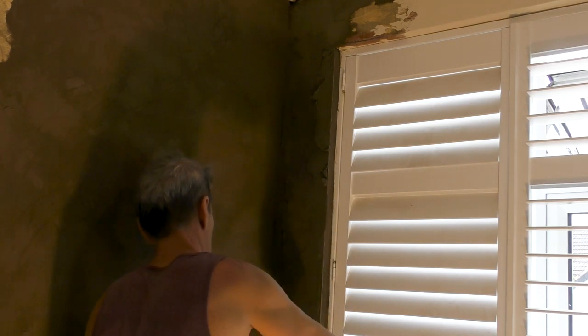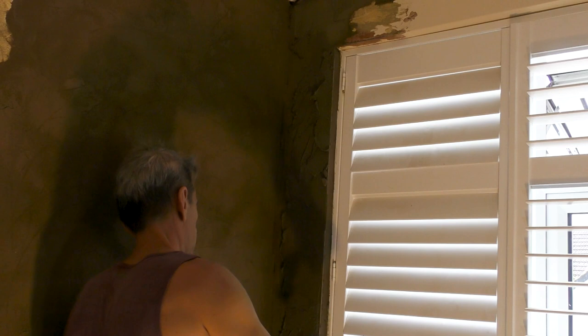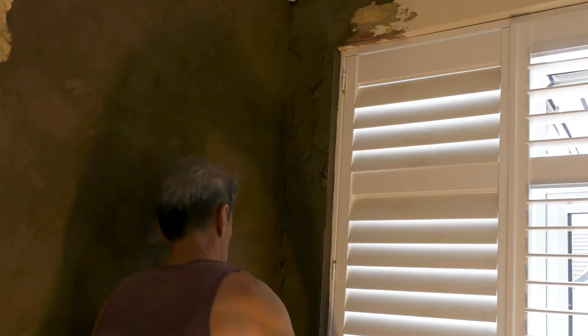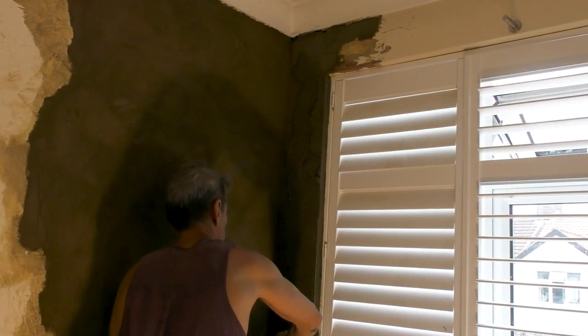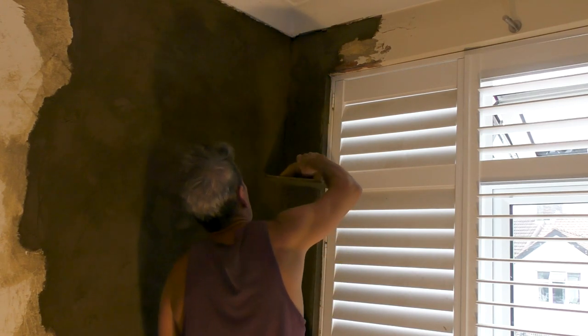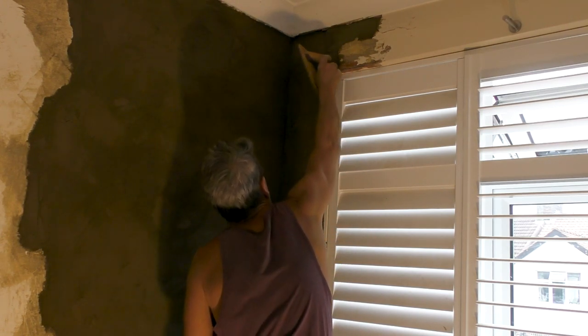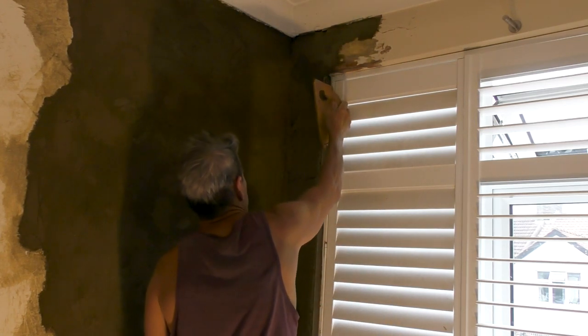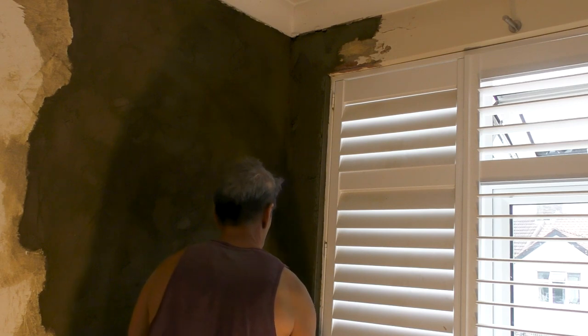As I say, if it was a bigger reveal you could do this slightly differently, but because it is so tight and I've had to literally build the thing back up out of sand cement, it's very delicate. Here I'm taking up the side - I'm using the side of my float to square this off. You need to make sure it's quite a new float because once the float's been worn in well, it doesn't have corners anymore - it just rounds right off, which would be useless for this part.